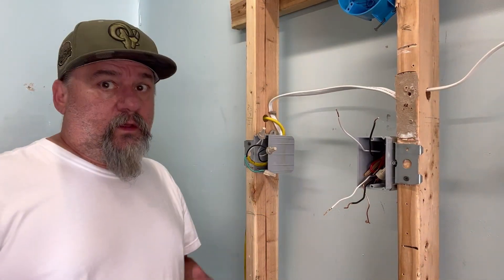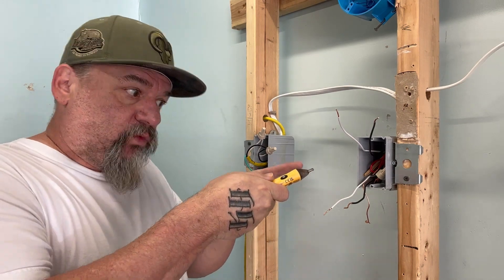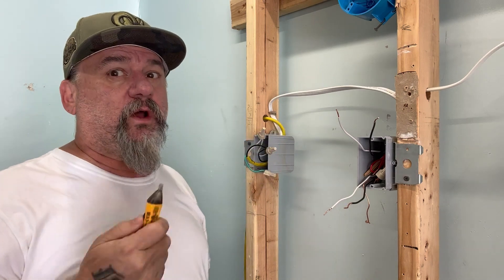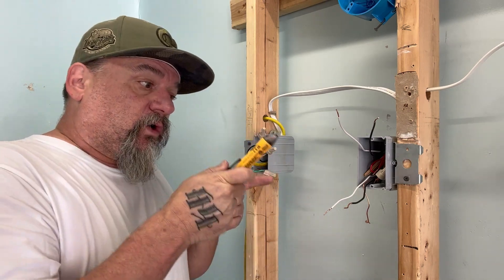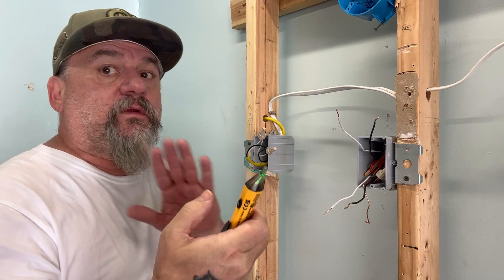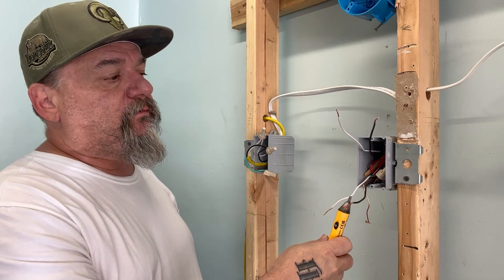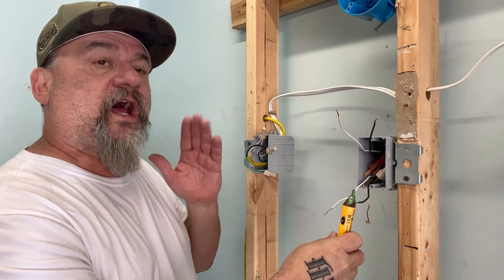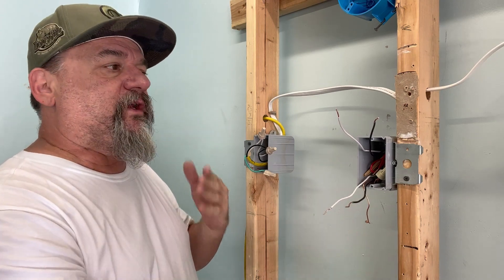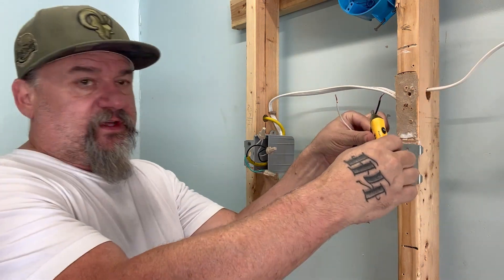First, let's cut that down and check for power on each wire so we know what we're working with. Power is back on because I took out the plug, separating each of the Romexes — one coming in, one going out. We don't know which is which, we just want to know which one's hot. You could use a multimeter across your hot and neutral to see if you get voltage. Sometimes this works better — there could be a false reading because there are two sets of hot wires inside the box. That strong pulse tells us this set is the hot set. Now we know what to work with — we have our starting point.